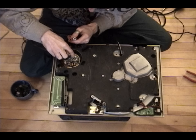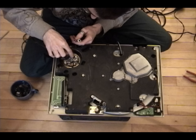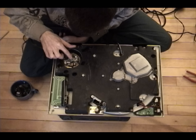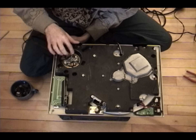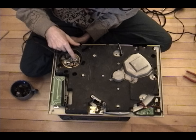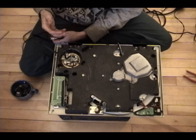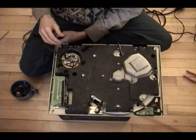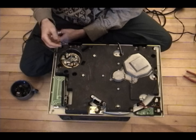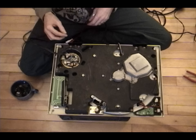The inside wires are color coded — red and white — so that's the inside contact. You don't want to solder to that. What we're going to solder to today is this green wire here, which is actually the ground wire for the cartridge. If you have a cartridge that is self-grounded, attaching it to this won't give you a hum. Some cartridges like the Stanton 680 have a ground strap, and some people have removed it — if you bought one used with that strap removed, you'd still get a hum. That's why we attach to the green wire, just for good measure.